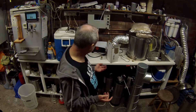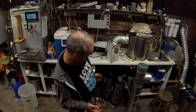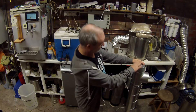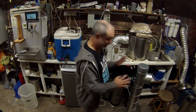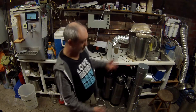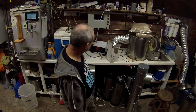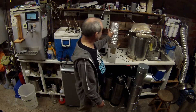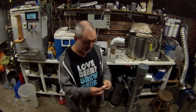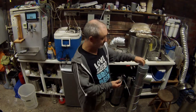In many commercial breweries you have steam condensers and I'm trying to make one of these out of some bits of ducting and stuff. What I have is a bit of solid ducting, a T-connector and end cap, and that's going to be the body of the thing. I'm going to cut this off a bit lower so it can sit in the sink to let the water out. I have a bit more flexible hose to connect that up to the top of the boiler, and to condense the steam I'm going to spray water in through the lid here.